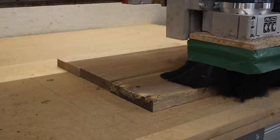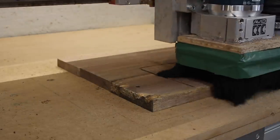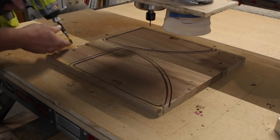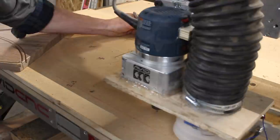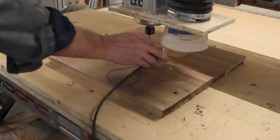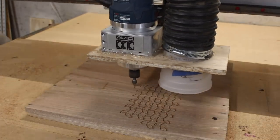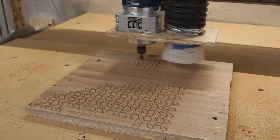I did all of the cutting on my Avid CNC 4x2 machine. I had also created a file for the bottom side of the piece — an eighth-inch groove the thickness of the aluminum at the spot where I believed the frame of the existing bumper would fit, so I could slide it over like a cap. But I knew it was going to be a tricky fit. I gave myself a little bit of leeway for error, but it ended up not being enough. I had to go in with a Forstner bit and cut away a little more material to make it fit properly. Later in this video I show how I solved this problem and talk about how I would do it differently in the future.